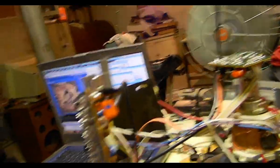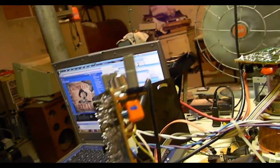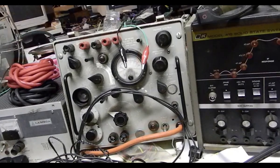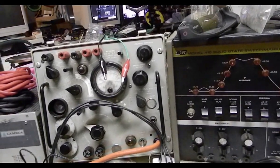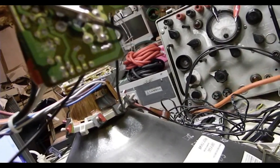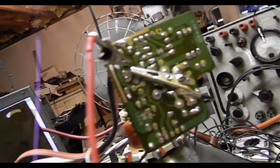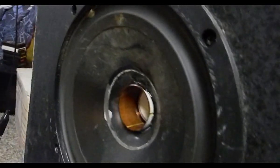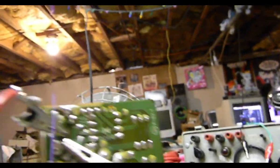I might be attacking the wrong problem here, but it probably should be attacked either way. And who knows — maybe I was having those weird horizontal issues due to the capacitors in the horizontal circuit drying up. I'm about done here, but this thing has the ability to test capacitors in-circuit and they'll roughly tell if they're all right. I'm glad I'm checking the neck board. Here's the capacitor. That's not good at all. Well, I guess this value could be large as far as filtering out the lows go, but it shouldn't be cracking like that. I thought these orange drop caps are supposed to be indestructible.